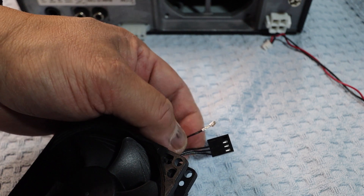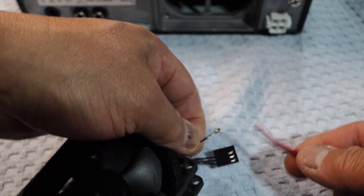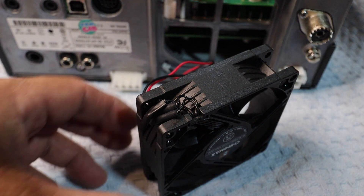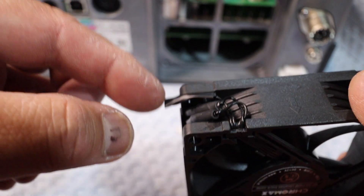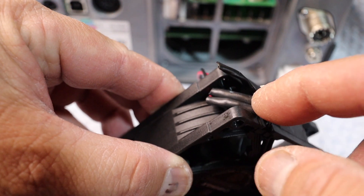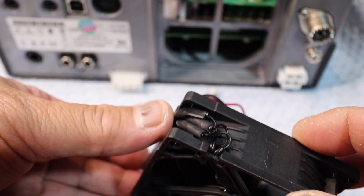I'm going to work on one at a time so I don't cross these wires. I'm going to solder them together — since that's negative, I'm going to solder the negative together. I finished soldering. For those extra two wires that aren't positive or negative, I separated those and put some electrical tape. I have electrical tape and also some heat shrink — I didn't have a small enough heat shrink so that's why I put electrical tape first.